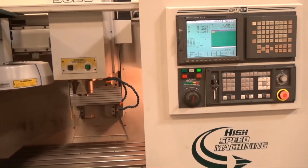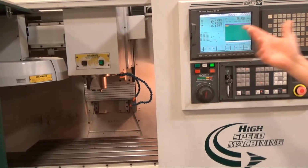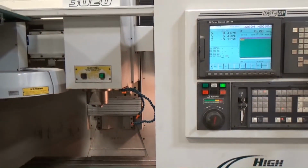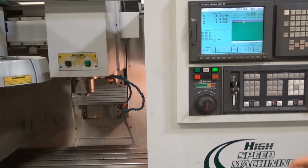It's good running spindle. And maybe a tool change. We can change some air tools. What do we got in there now? 7? I'll jump a couple places to maybe 10. We're still in MDI? Yeah. We're still on program. T10 maybe. And let's try that.